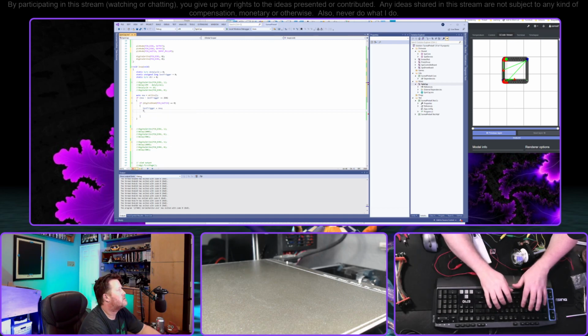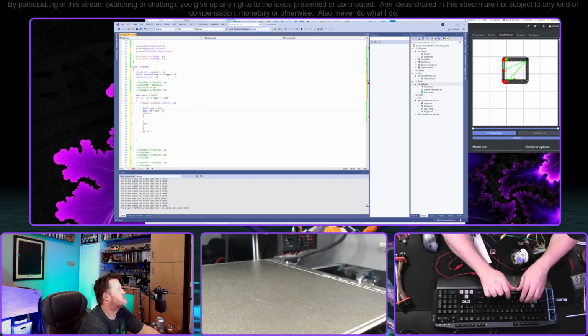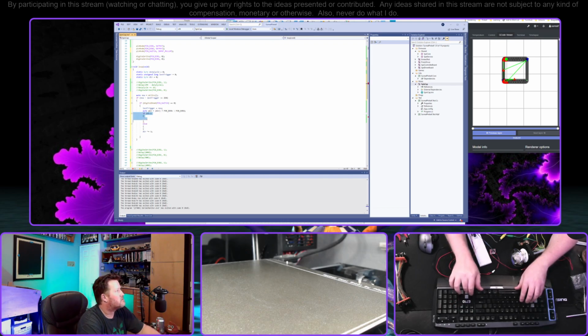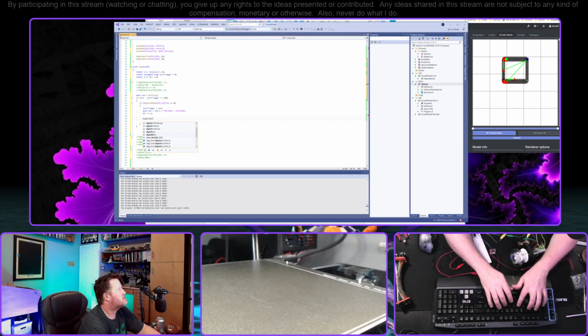So if we're going in one direction, well, here, we'll do this. Pin equals dir. There. Having my keyboard all the way over here, I fat finger typed Windows key down, I guess. Okay, now we flip the direction, and now we want to do a digital write. Pin one, delay 250. Sure, sounds good. Pin back to zero,